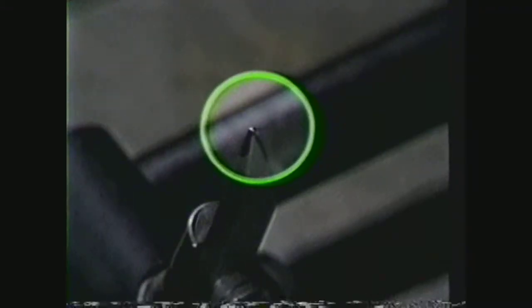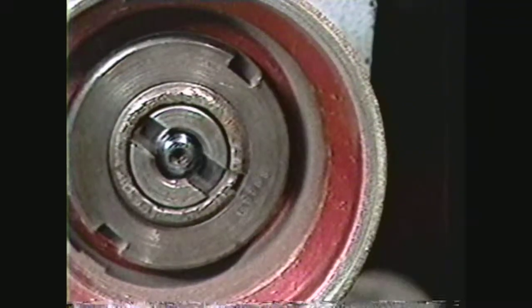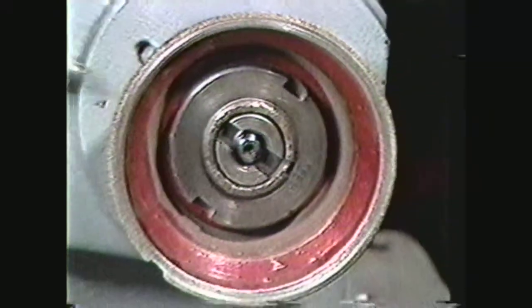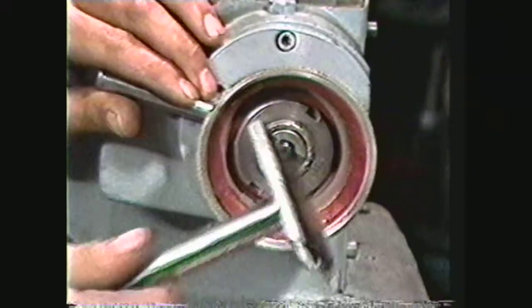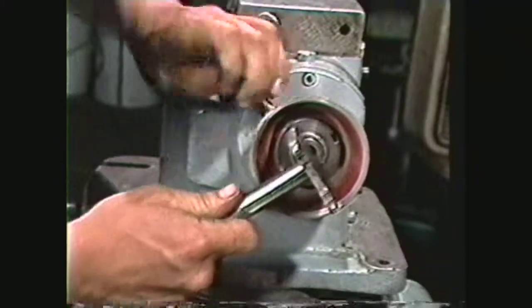A shiny contact point will appear. Using a diamond hone, you can hone in the finger contact point until a pass removes all the blue dye. The Borazon wheel is trued flat and generally has a 1/16th inch surface area. After mounting the wheel, check for tightness of the spanner nut on the hub and the spindle nut on the wheel head spindle.